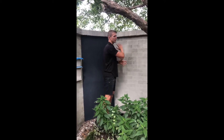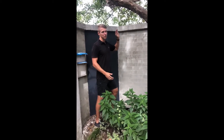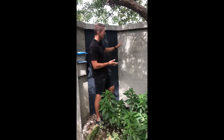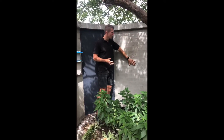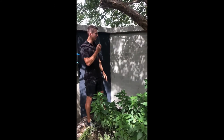A sharp rendered look would be a perfectly smooth finish the whole way around. They did want to update the paint color and smooth out the wall a little bit. So what we're able to do here is apply a bagging coat of cement render over the top — you can either do this in a smooth finish or a rough finish. They've gone for the smooth finish here.